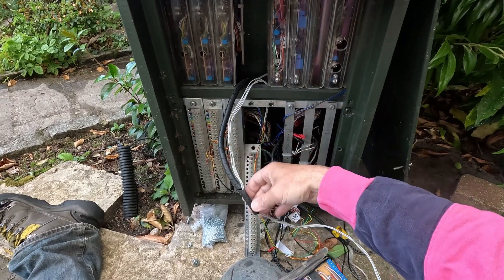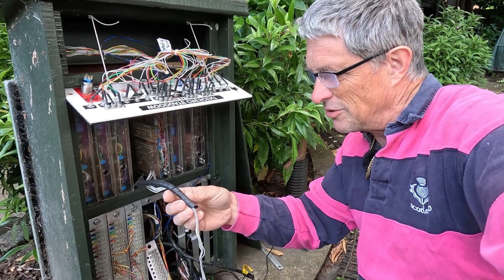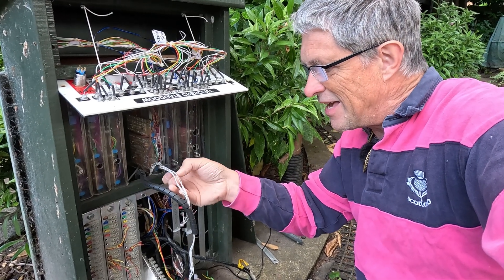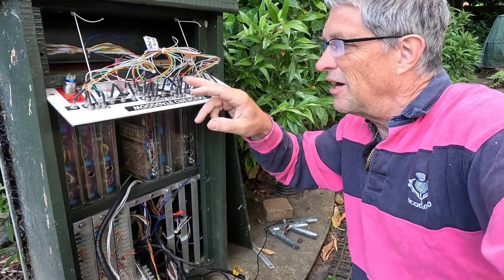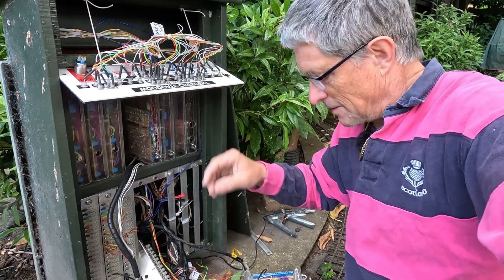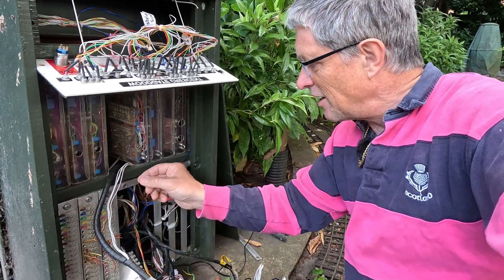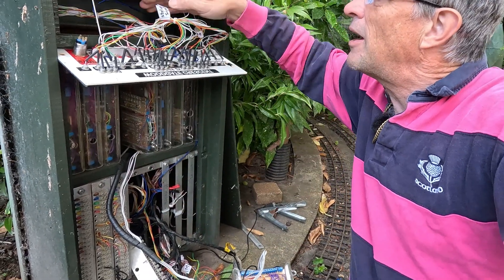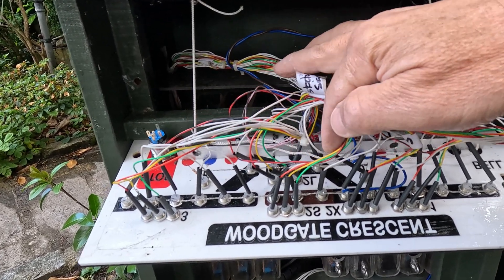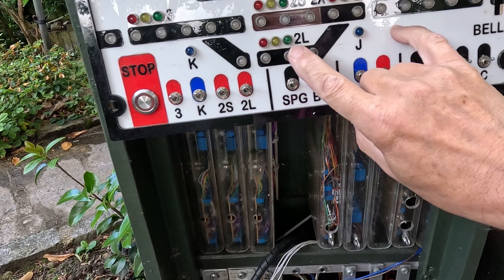I've had to maintain a really logical approach otherwise I would get confused. Each of the modules has a linking bundle that I wrap up with this coil thing. Some of the wires go directly straight up to the mimic panel - those are the indicator lights, because they don't go anywhere else. The indicator lights represent where the train positions are. So those five individual white wires come out of the back of the module, sending the signal for each of the indicator lights, and they come out in this bundle up the top and connect to each of the little groups of indicator lights. The set I'm looking at this time are these five here: one, two, three, four, and a shared one.